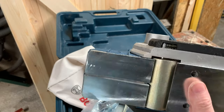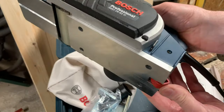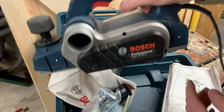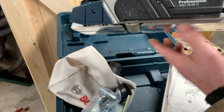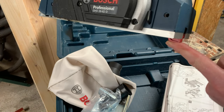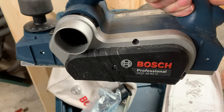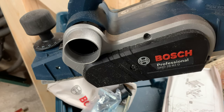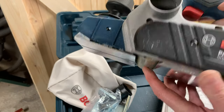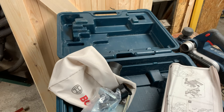The chamfer groove puts a nice finish on the wood. At the back there's a little red knob — I was wondering what it was at first. What it does is act as a stand: when you put the planer down on the bench, that red knob keeps the blade raised off the surface. On the old planer it would sit flat, but this cocks it up and prevents the blade from rubbing on the desk while it's still rotating. That's fairly handy.